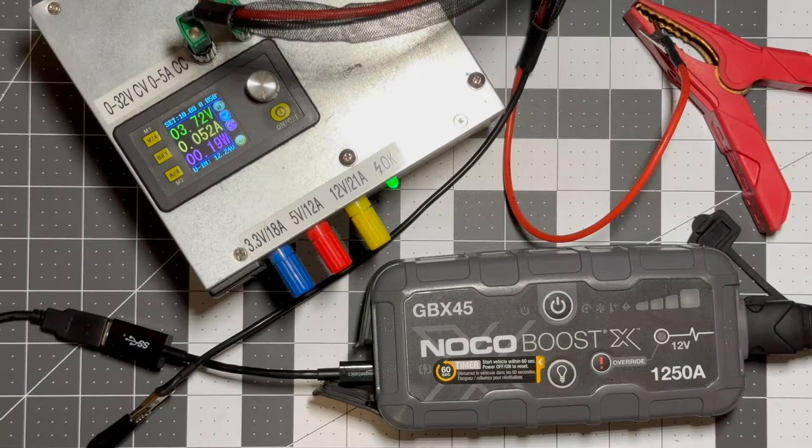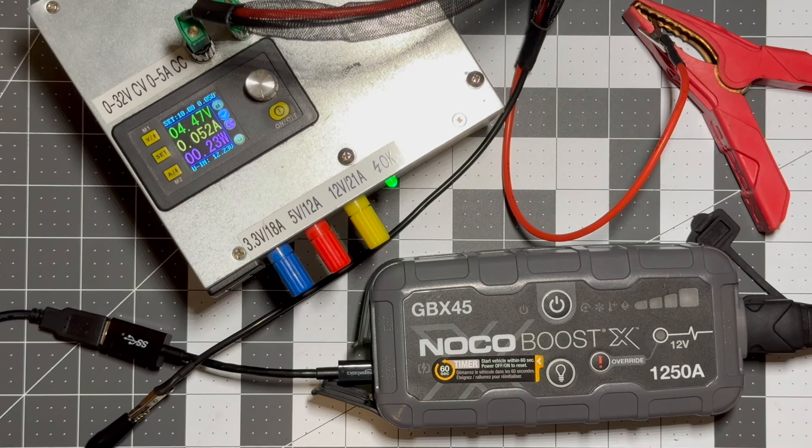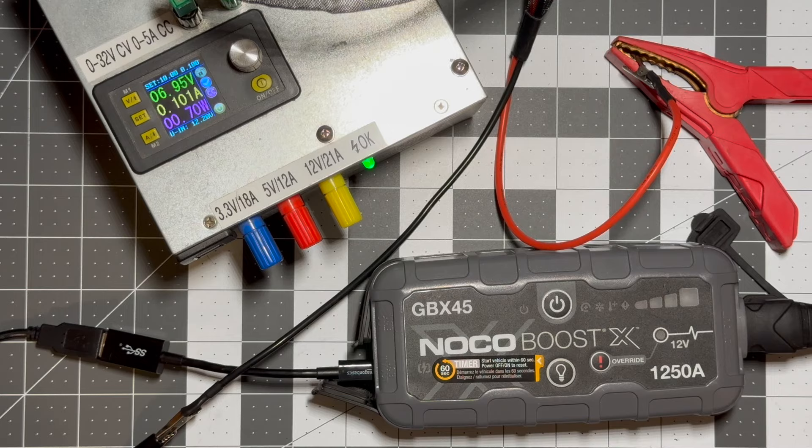And that's what I wanted. Remember that there's four cells in series inside of this, and each cell maxes out at 4.2 volts. So maximum voltage when all four cells inside of this are at their full potential would be 16.8 volts. Generally those cells shouldn't be discharged past three or maybe 2.5 volts at the lowest. So 2.5 volts per cell would be fairly low. In this case we started out at two volts for the whole pack. I'm going to let this sit for a little while and continue to charge up. I'm going to stay nearby and just keep an eye on it until we get to about 10 volts.